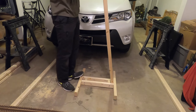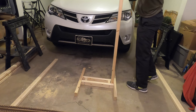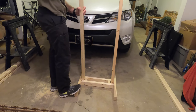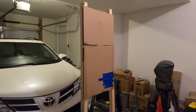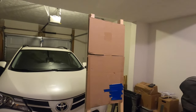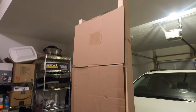Set the base down and put the six-foot uprights in there. If it doesn't go in, you can always use a little good old-fashioned American persuasion with a piece of scrap wood or a rubber mallet. After you get the six-foot lengths in for the uprights, go ahead and staple some scrap cardboard to the upright, and there you have it — some simple do-it-yourself wooden target stands.